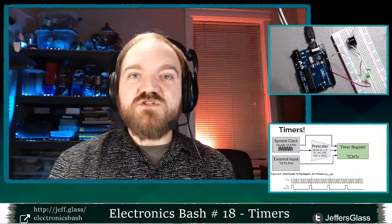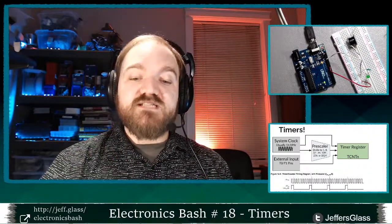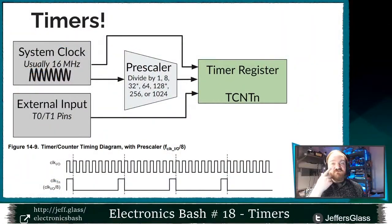This is really useful for things like feeding in data from external sources where you're not entirely sure in advance what the clock rate will be, or it might drift a little bit, or it might be waiting for a sequence of 13 incoming pulses from a specific signal line, and then we should start listening on it for some data. So it might be more useful rather than having a predefined series of speeds. Maybe we want to have these counters count individually from external events.